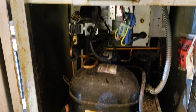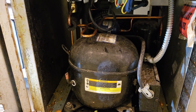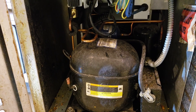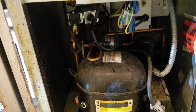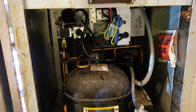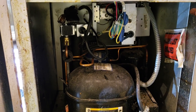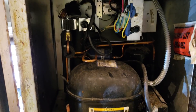When I got here, my temperature controller said 'run error' and the unit was short cycling on and off. I put my service gauges on it and it was acting like it was pumped down - I had low head pressure and my suction pressure was just on, off, on, off. I've had a history with these boxes before where I've had bad glycol pumps, so that was the first place I checked.